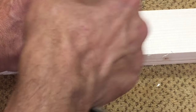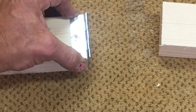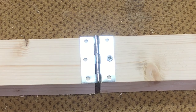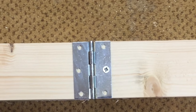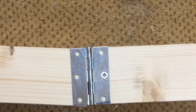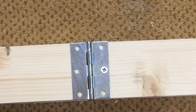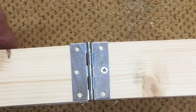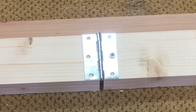I'm going to drill because I'm right on the edge and I don't want to split it. I'm using those gaps to get things lined up — that takes off the glint from the fluorescent lighting so I can see that I'm straight. I've used those two gaps there to see that my material is straight, and I can also lay a straight edge along here to keep it straight.